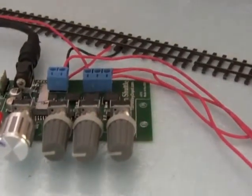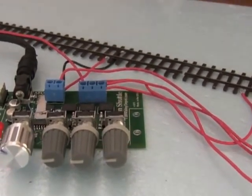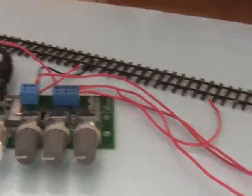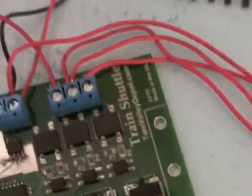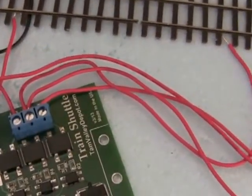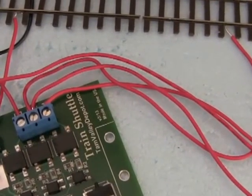So how does the circuit work? This box here is sending DCC speed commands continuously to the track for engines 1 through 99 in a continuous loop. The silver knob controls that speed. And I've got three diodes here set up as current detectors for the three sections — end one, end two, and the middle.